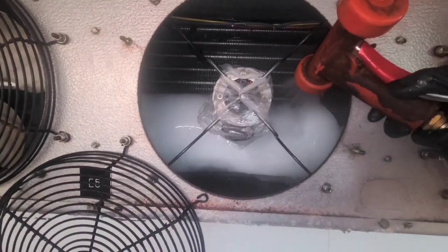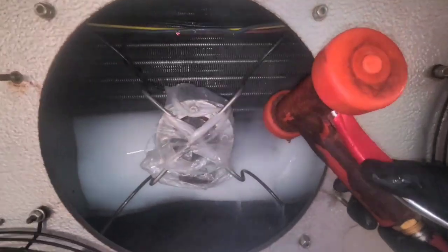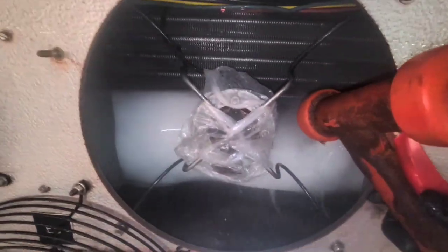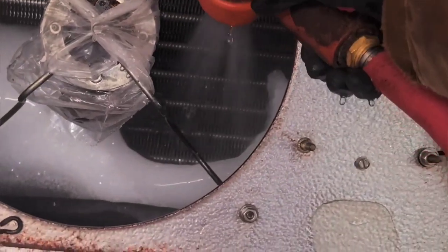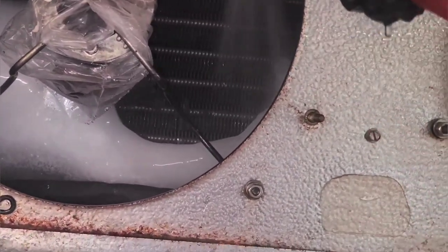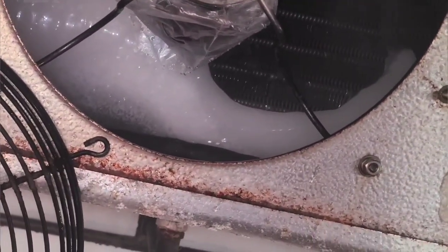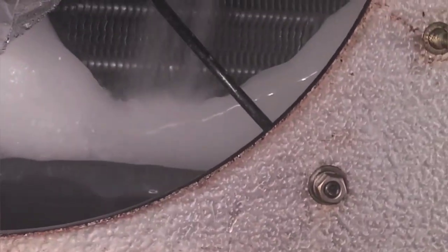It's a good thing we got some hot water here. It is pretty freaking hot. I've never had a motor short myself, but many people think that it happens. I believe them. I personally find it easiest to get behind the ice and up against the coil, and to get the ice off of the coil, like a vertical clearing, and let the glob of ice fall forward.